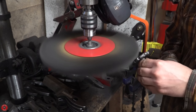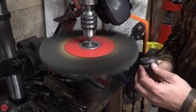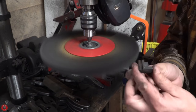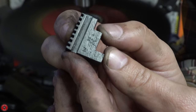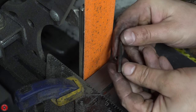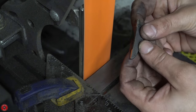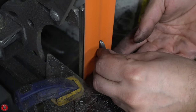I'm using a 16-inch wire wheel on my new radial drill press. The radial drill press lets me fit such a massive wheel on it, and so far I like it — just testing out whether it's worth it. Here I'm cleaning this up on the belt sander. It doesn't need to be very accurate at all; it just needs a nice flat edge to reference off when you're turning whatever you happen to be turning.